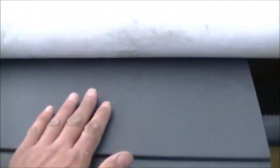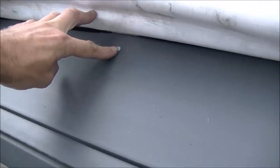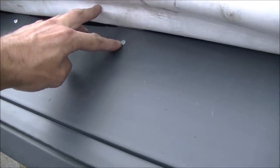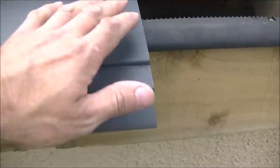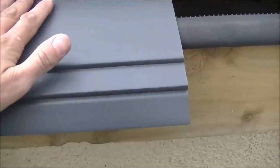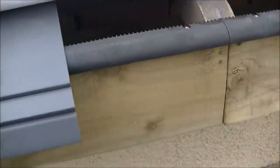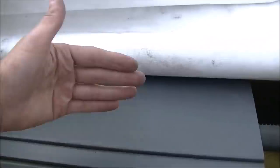These are the felt support trays. We've butted them up to the batten — the last batten on the roof — pushing them as far as we can. We're using 30mm galvanized nails through that. The important thing is to overlap these by about 10, 15, maybe 20cm. Don't put your final nail into the rafter until you've overlapped the next one, then work your way along. These are trimmable so you can trim them down to size if you need to bring them in or out.